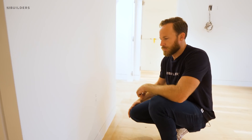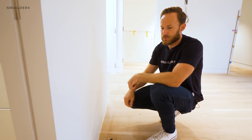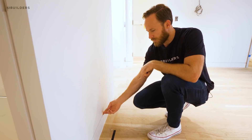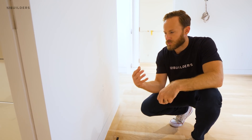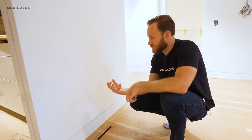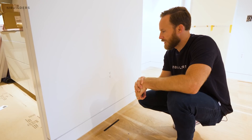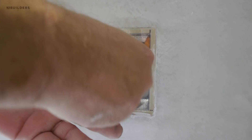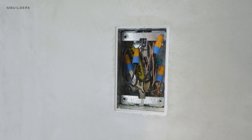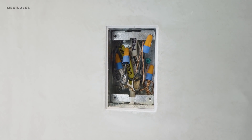Realistically, if it was slightly out you could feather the plaster in either direction, but then you're dealing with the reglet detail below, and that reglet needs to be completely flat with the baseboard. Rather than working around something without adjustability, we made them adjustable by flipping the screws around — Steve over at Van Gerven figured that out and set us up for success. From there we plastered everything in, and once it's plastered, the box is in and it's ready for the devices.